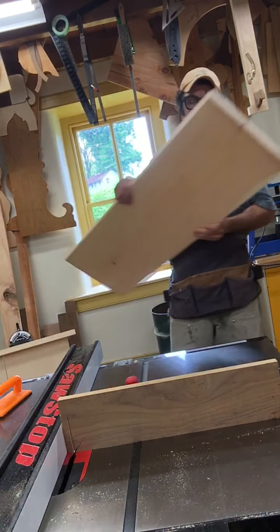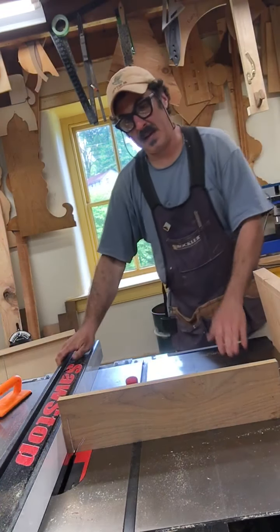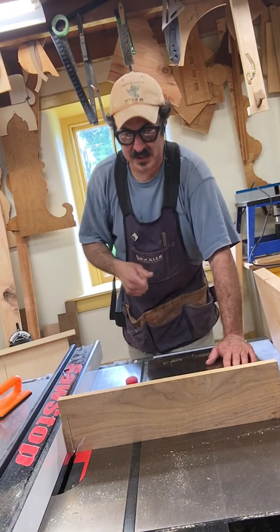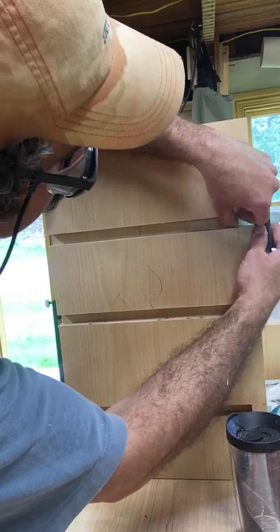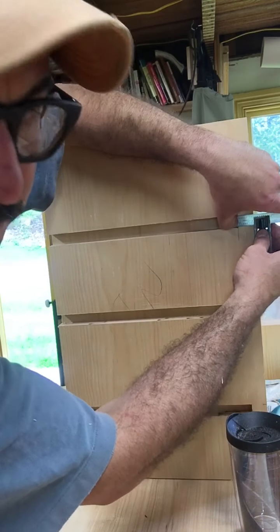That's going to cut out and we're going to slide forward. The reality here is that for me to get this exact same setup again is possible, but it's not real easy. So what I may want to do right now is measure back how far back these have to sit and then we'll bring the blade up to that height. I believe it's one inch, and I'll put that right there — and that's about the height of the blade that we want right there.